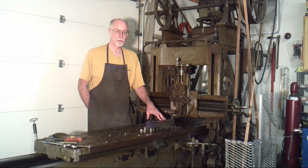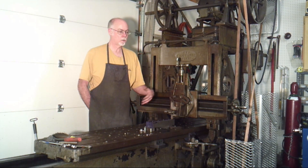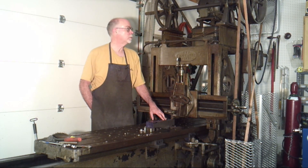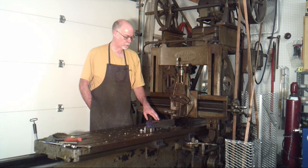As it cut across at one point, the belt started slipping. So this isn't a horsepower issue — this is just a drive issue; the belt was slipping on the upper pulley. I got a can of belt dressing, sprayed the pulleys down, and that basically solved the problem, so I was able to go through.